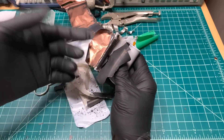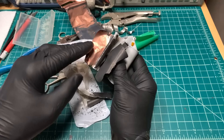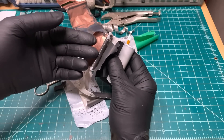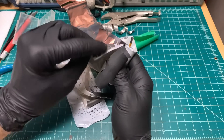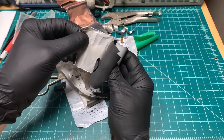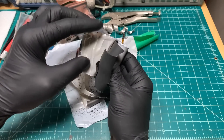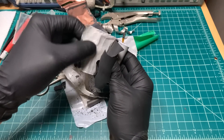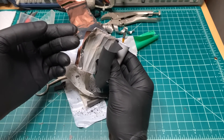They're trying to improve the performance of water-based electrolytes, which means the battery won't burn if it reaches thermal runaway or gets short-circuited — at least the electrolyte won't catch fire. For the separator, sometimes they use two different plastics put together, one with a lower melting temperature than the other. At a certain temperature, the lower-melting plastic will melt and partially or completely block all the tiny holes in the separator, while the higher-melting plastic maintains its structure. That blocks ion flow — another way of turning off the current as a safety feature.